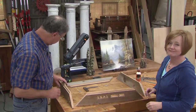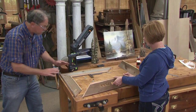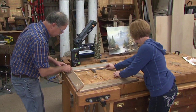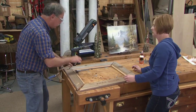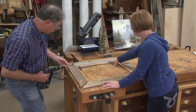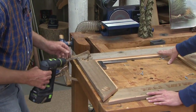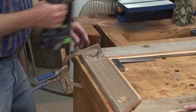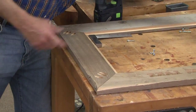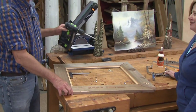We've sized glue on all of the corners — it'll be mated together. I'm bringing this corner up and clamping it down using an auto-action clamp, making sure the inside corner is square. I have this set so it will not strip out the threads in these coarse one-and-a-quarter inch long square-drive screws. I draw all four corners together using the same technique. Susie wisely asked me if it was the proper size for Silver Lake, and minor adjustments were made.